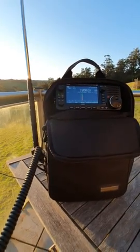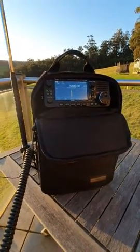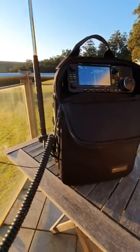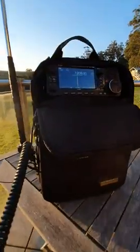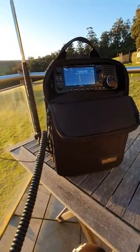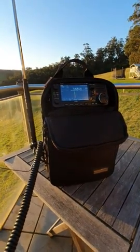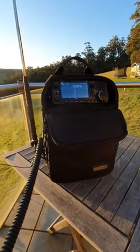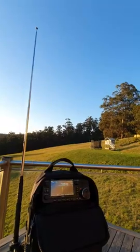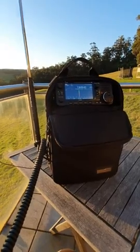It's been quite outstanding, actually. It's an IC-705, a brand new ICOM SDR QRP portable rig, and the antenna is a Comet HFJ350M, which is a Japanese-made telescopic multi-tap whip. The only trick is I'm running about 8 metres of counterpoise wire — single counterpoise — plugged in directly to the earth connection on the underside of the whip antenna, which is all mounted on the backpack. So it's kind of in a little man-pack configuration at the moment, Orb, and working very, very well. I'll actually be able to send you a video of this — I'm recording it on the phone.